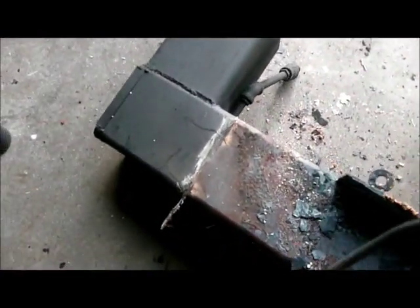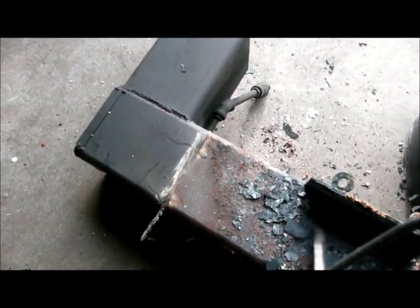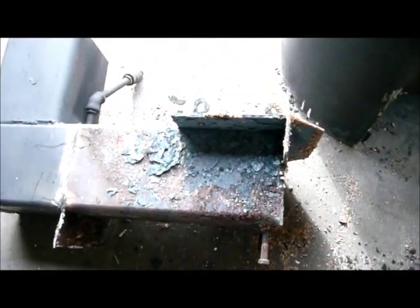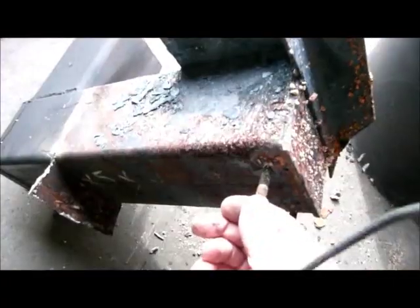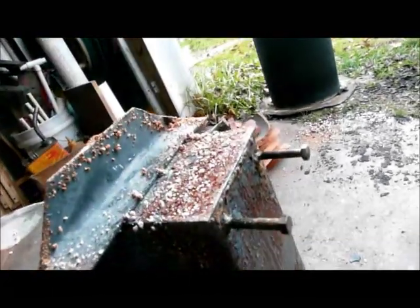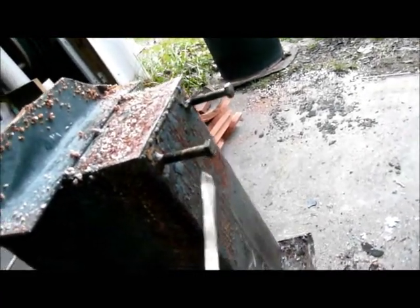These areas back here are half-inch, and I'm flaking steel away big time. I guess I'm going to have to get some 304 stainless. And even on the bottom, on areas that are away from the heat, heavy scaling is going on — and this is areas away from the heat.